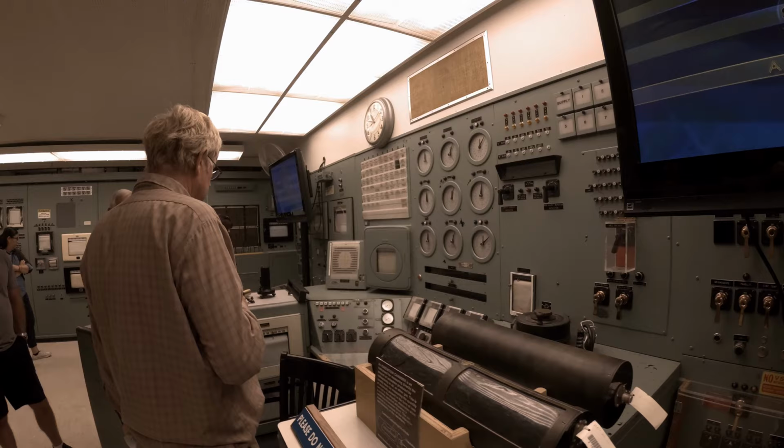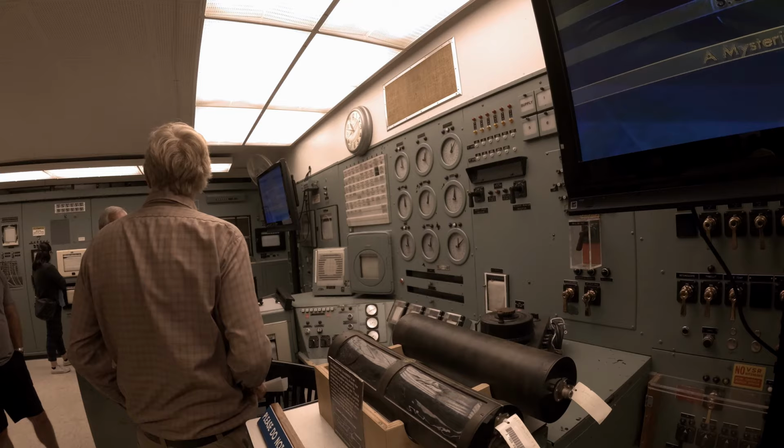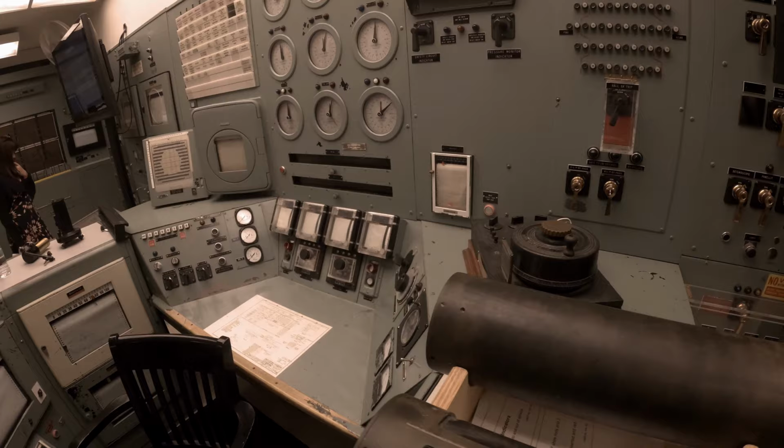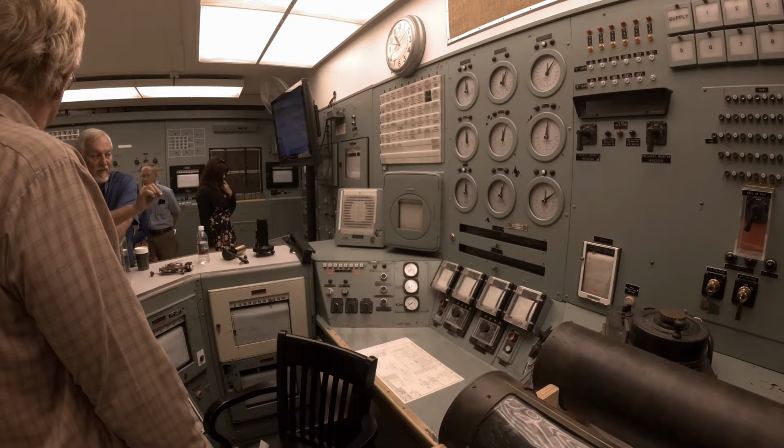These were a selection switch you could pick, which one you want to hold. You just watch for the power. Power was on this central panel, the galvanometer. The top one would give you power level, and the bottom, I think, read out in terms of neutron flux, so the actual neutron measurements that were taking place inside the reactor.